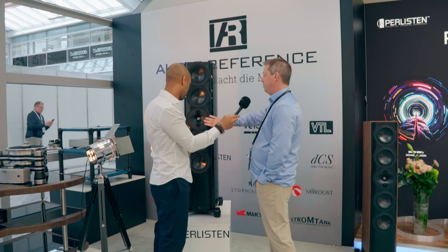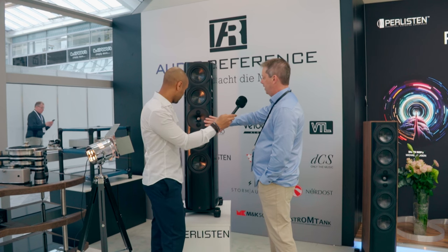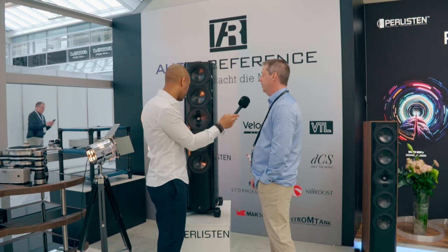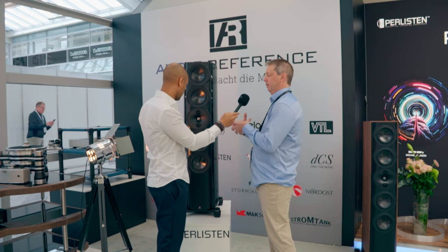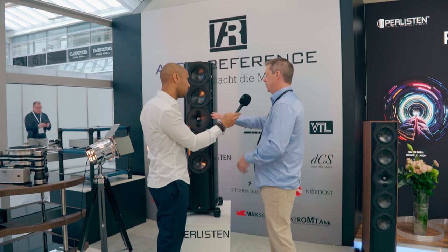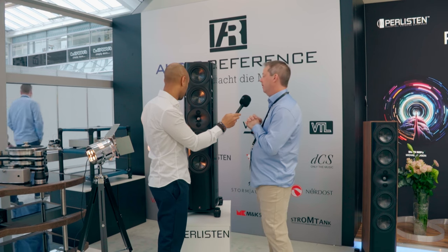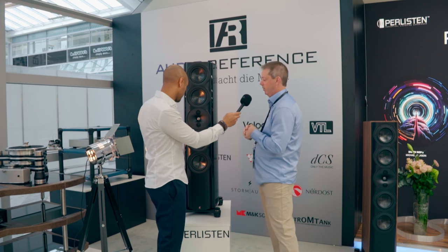The DPC array, it's the same waveguide geometry, but you can see already the heatsink is cold because it's made out of billet CNC cut aluminum. All three diaphragms are now coupled to that aluminum waveguide, which doubles as a giant heatsink. And that heatsink thermal manages all three domes to the same temperature, almost like a transistor on an amplifier. Otherwise, though, the DPC array is very similar. The beamforming is very similar.